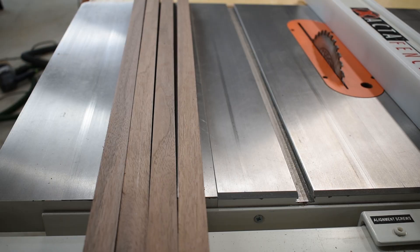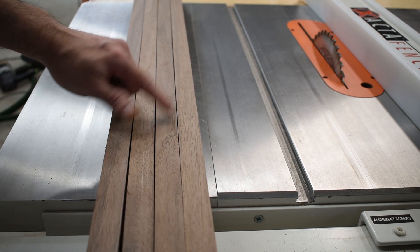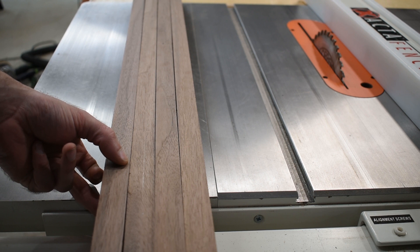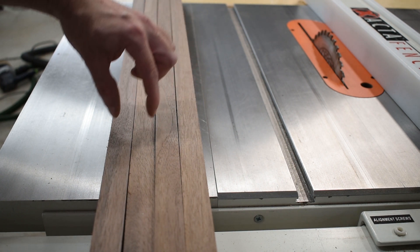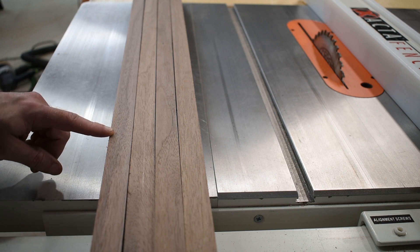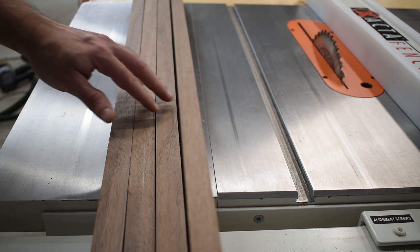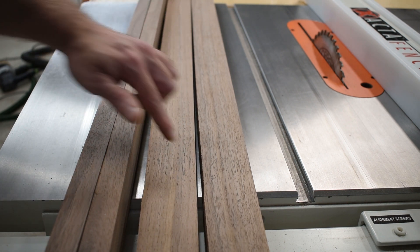Let's talk about grain direction when milling lumber for the cabinet door. All these pieces came from one walnut board. The face of the board has the typical cathedral grain you see in most lumber — I don't find that ideal for a door aesthetically. My lumber is a little over two inches thick, which is wide enough for the rails and stiles. Instead of cutting a wide board into two-inch wide pieces and getting flat-sawn cathedral pattern, I'm going to use the lumber's thickness to my advantage. By leaving the boards thick and cutting them into one-inch slices, I can flip the boards over and get a nice straight grain, which looks much better for a door.